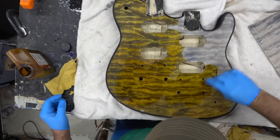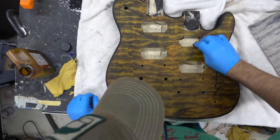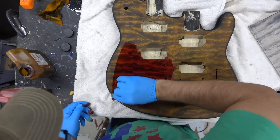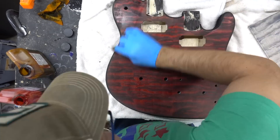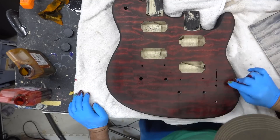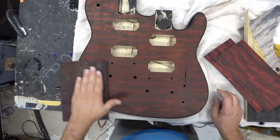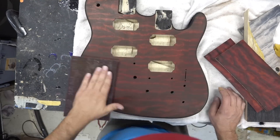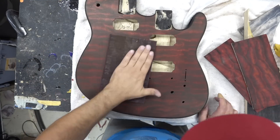So this is the orange — two coats. You want to apply the red immediately after you put down the orange. There's the red, all wet — two coats. Let it dry 24 hours. And then this is where the magic is: you've got to come back and pull a little bit of color back out. I've got kind of like a Brillo pad mesh pad — this just pulls a little bit of color out and makes it pop. Keep that hand flat so you don't get any gouges.